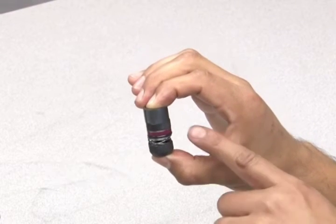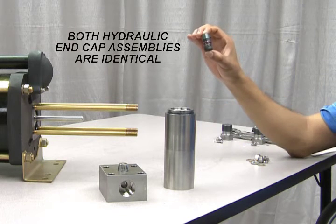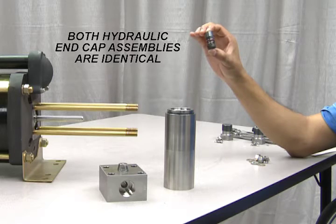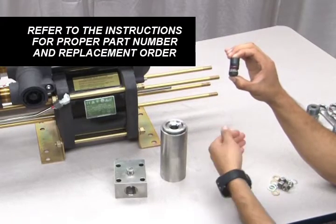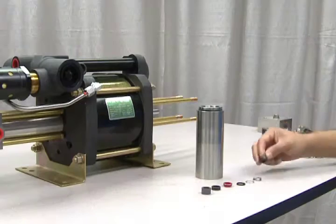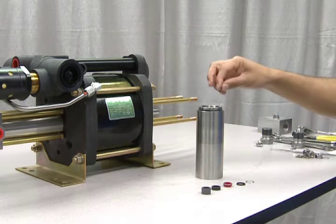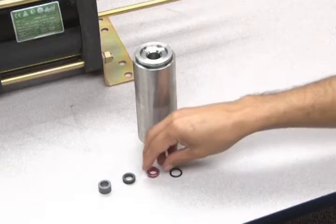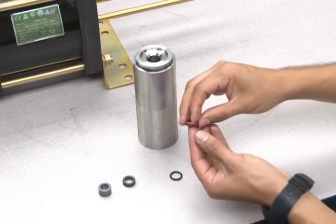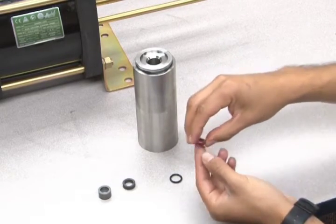You should also inspect the other parts for wear and order new parts separately if necessary. Both hydraulic check valve and cap assemblies are identical and require the same maintenance and reassembly procedures. When replacing the seal package, you should refer to the instructions for proper part number and replacement order. First begin by replacing the lower bearing, the spring, and the backup. Next put together the o-ring, cup seal, and extrusion ring facing downward, then place them into the hydraulic barrel.